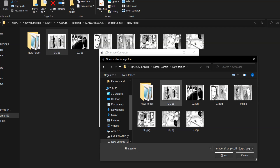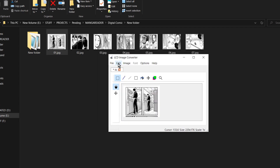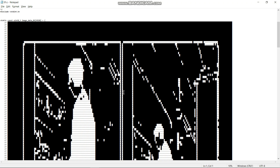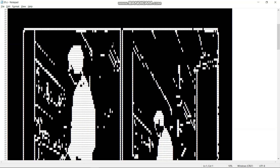After resizing the images, we run them through an image-to-C converter. It basically turns images into C code, which we then include in the main code, which then runs each image one by one in a loop.